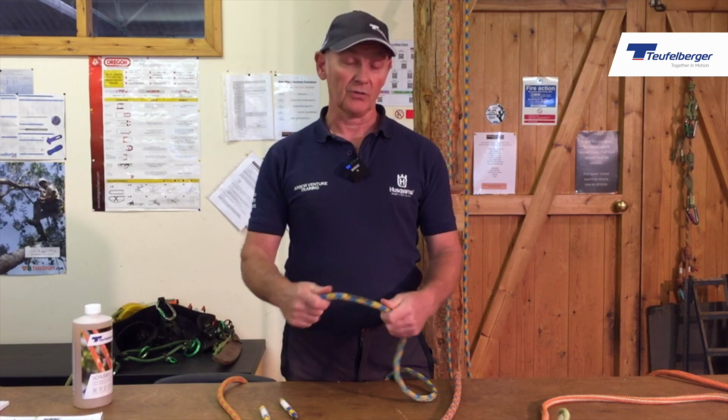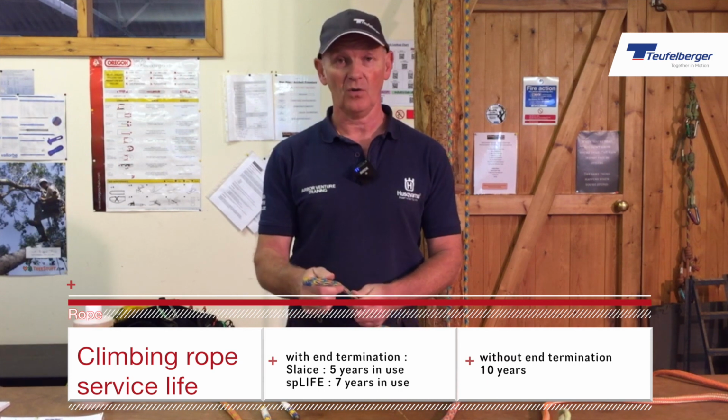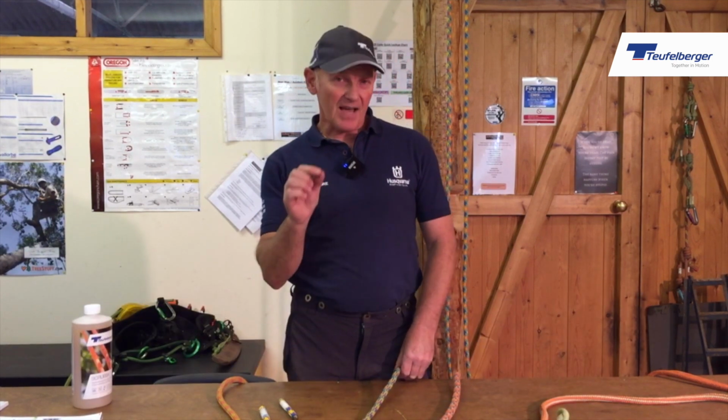What Teufelberger will do is give a maximum age of their ropes of 8 years, with 5 years on the job. So you're just using your rope at work every 5 years and then you'd retire it. That's the maximum lifespan of that rope.